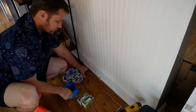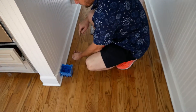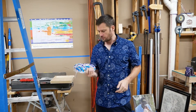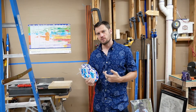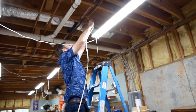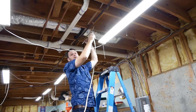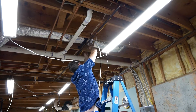I've already drilled the hole on the other side as well. I've got 50 feet of 14-3 Romex — 14 means it's 14 gauge, this is a 15 amp circuit. Three means you have one neutral and two hot wires, and we'll need two hot wires because we're doing a three-way switch. I'm going to run this wire through the studs, and I've already got some holes from previous electrical work, so I'll run this down to the other end of the room and connect up through the different stud bays to the different light switches.